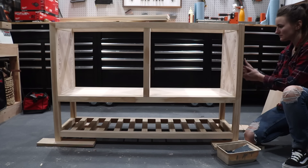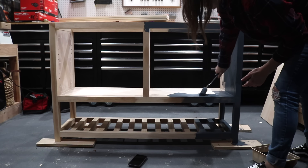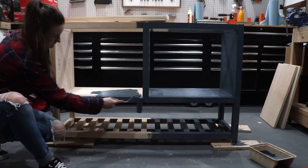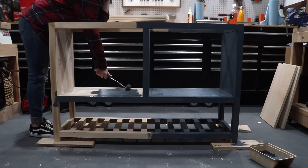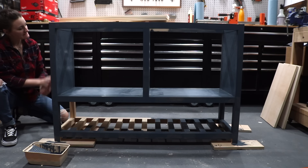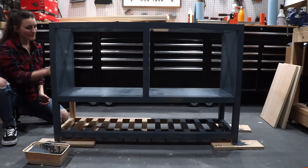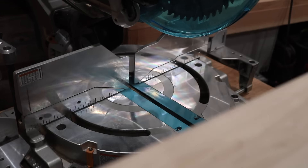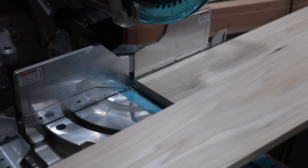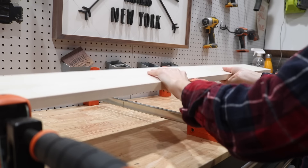I've been experimenting with different wood finishes lately and decided to try cabinet enamel, but I didn't really love it. I think it's because I didn't use primer — I really just need to start using primer — it didn't dry the way I wanted and made photographing the piece difficult. Overall it had really nice coverage, was easy to apply, and took about three coats with sanding at 320 grit between each coat. I think I'm going to go back to latex paint next time, because that worked out really well on my live edge cabinet build. As the cabinet dried it was time to work on the countertop — I used poplar because I love it, and cut my poplar pieces into three separate strips to laminate into one solid countertop.